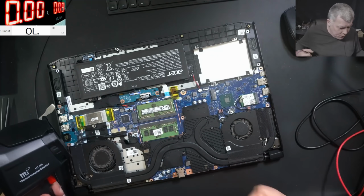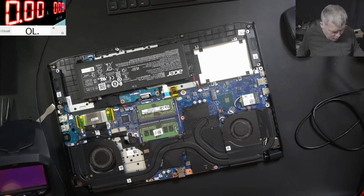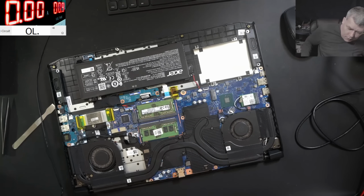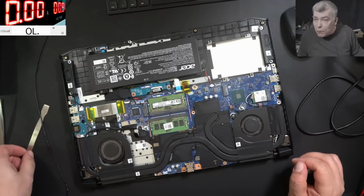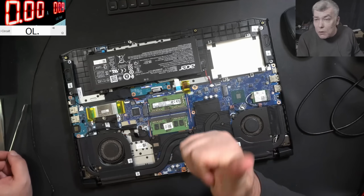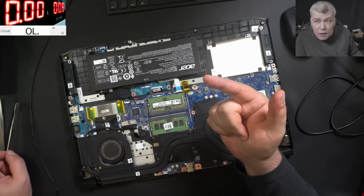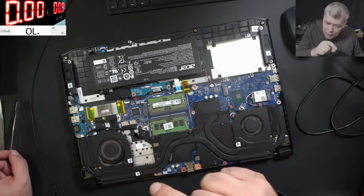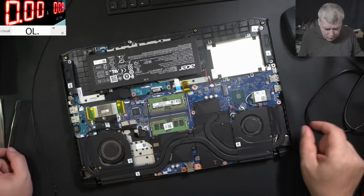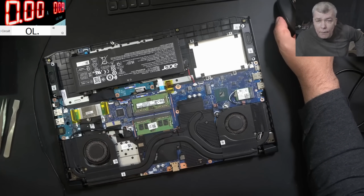Yeah, that sucks. Always it will happen. Always, you know, the chipset will go dead. Because of what? Why? Because the battery was not disconnected when the screen was replaced, or because the screen is not the same. Yeah, it has to be exactly the same based on the model number from the back of the screen. Well, that was a short job.